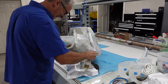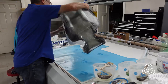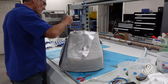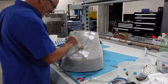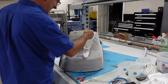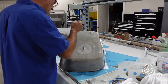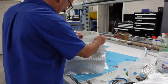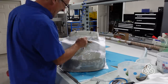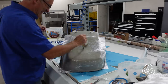Once we turn the chair around and start laminating the bottom side, we have to allow for those bolts to be covered up. It's pretty simple — lay your fabric on, and as you stretch it across, nip a little hole in there with sharp scissors, and then laminate around them. Extra reinforcements can be added to each of those bolts — cut a piece of patch material, concentric fabric that's a little bit wider each time it goes out. The size of the flange on the bolt and how many layers of fiberglass determines the pull strength on a bolt like that.